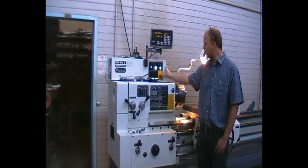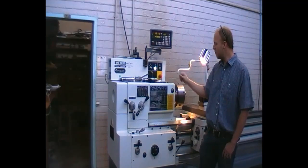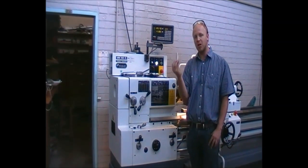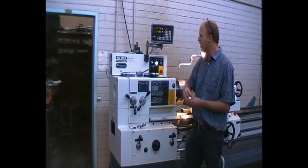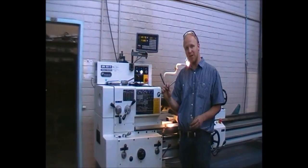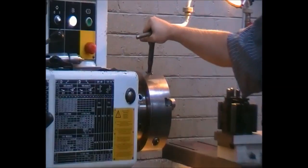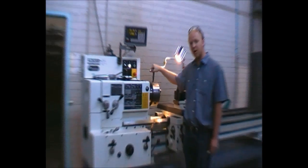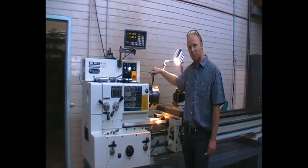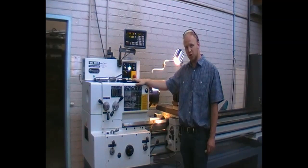For demonstration purposes, to fasten your part, make sure the emergency stop is currently active. Before clamping the material, the part must be clamped in using the T-spanner. The T-spanner is the most dangerous part on a lathe. Should the T-spanner ever be in the chuck without your hand on it, you will be asked to leave the workshop. If you are not tightening your part, the chuck key is either to the side or in the cupboard.